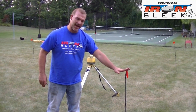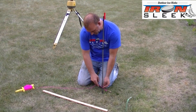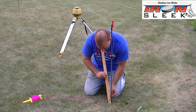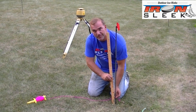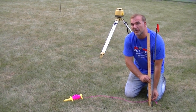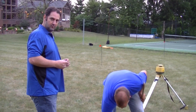I'm assuming this is the highest spot. What I'm going to do is put a little loop here and set that loop at four inches. There's a good reason why it's four inches — if I'm right, we're going to be looking at that as our water level. I'm giving Matt the line level and we're going to get started toward stake number two.